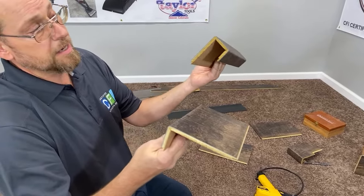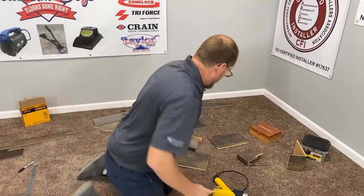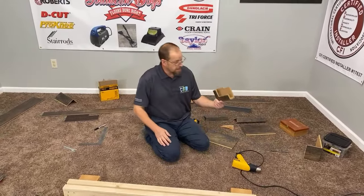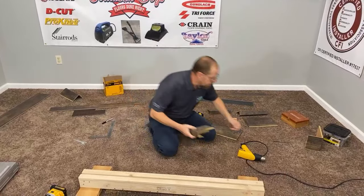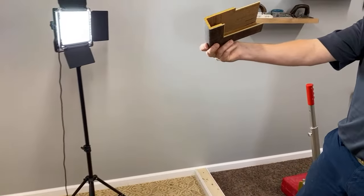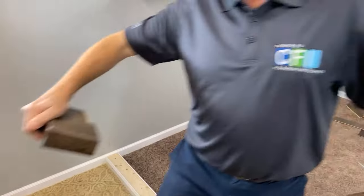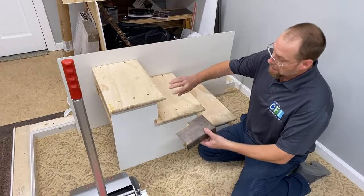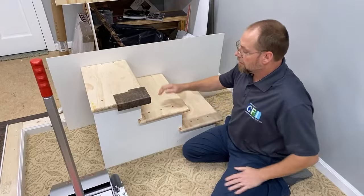They're going to hold up excellent, just like the flooring would. There are so many reasons why a person could do this. I've done this just to show that it can be made and cut for actually wrapping steps. Let me put this on the step and show you exactly what I'm talking about — it goes on the corner of a step, and I just cut my 45 on it to make it fit right on the corner.